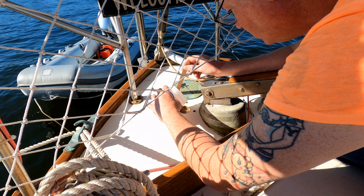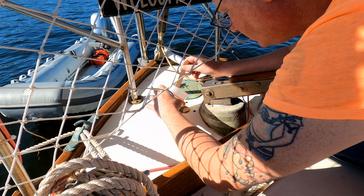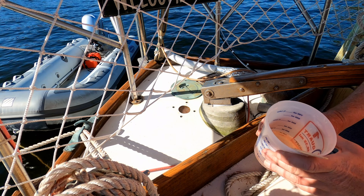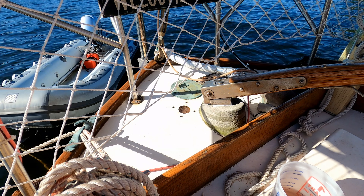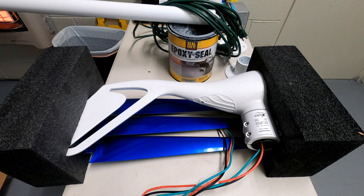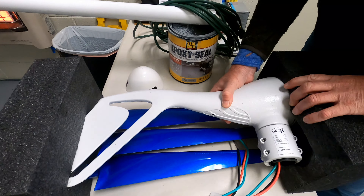Since it is carbon steel I had to get it painted and protected as well as I could, so I primed it with two coats of primer and then painted it with two coats of white paint. The weather in Belhaven was quite nice and I was able to get two coats done each day. I sprayed one side, let it dry for about an hour, then rolled it over and sprayed the other side, waited two more hours, and repeated the process. Priming done in one day, painting on the second day.